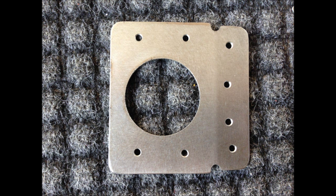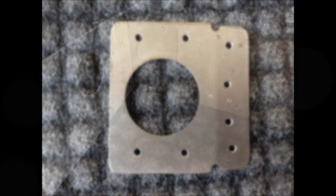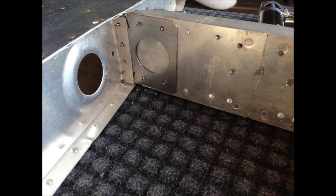In this particular one, we've added two more holes where the rib flanges are — one at the top and one at the bottom. So originally there were six holes, now there are eight. Once you have that established, Cleco everything in, look at it, and make sure you're happy with the locations.